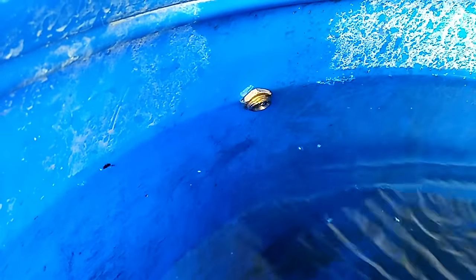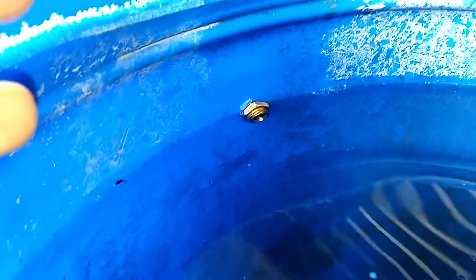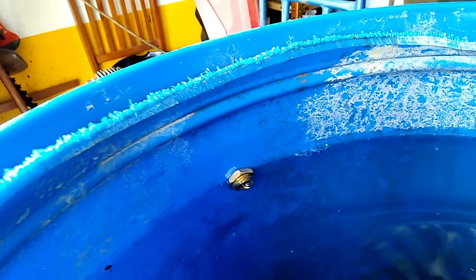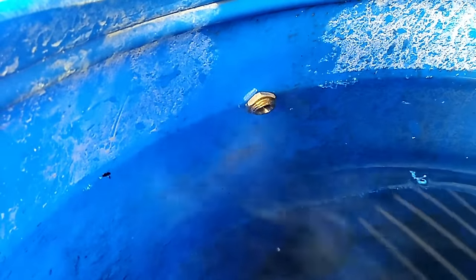It actually sucks back. It has a big gulp. And so what's happening now is because it has an opportunity to suck back, it's bringing more water into the system and keeping the siphoning process more consistent. It's actually sped up the whole process. I suspected that would be the case. I don't know why, that was just my gut feeling that both ends sort of needed to be under the water for this to work better. And that's sort of what's happened.